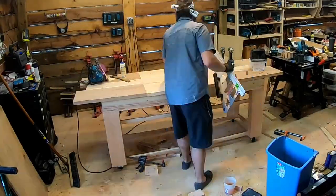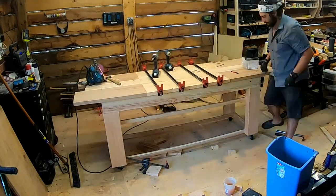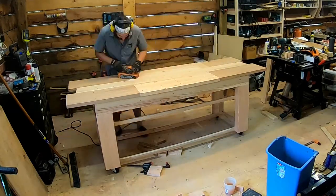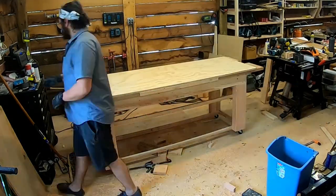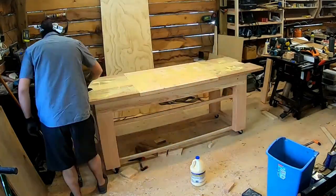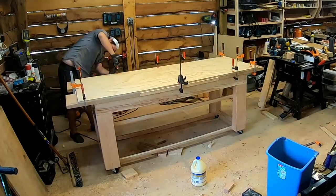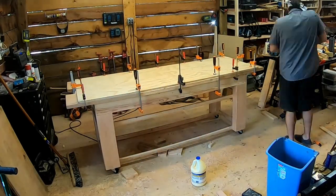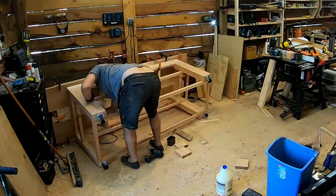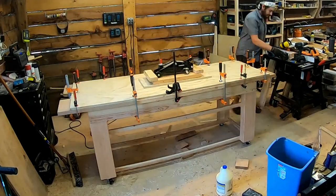Here you can kind of see the whole jigsaw puzzle getting glued and clamped together to form a solid wood surface on top of the bench. Then to unify the surface I'm going to glue down a large piece of decent-grade plywood so I'll have one nice flat surface rather than a bunch of stuff glued together. I used the old Japanese boat builders' trick of clamping things against the ceiling of the shop, but with a car jack instead.